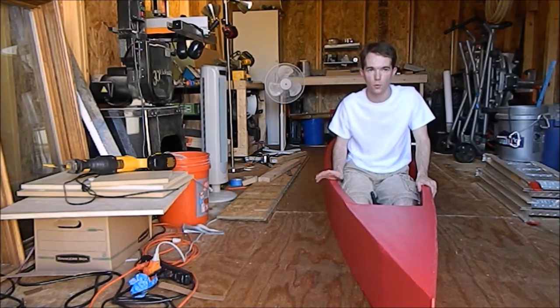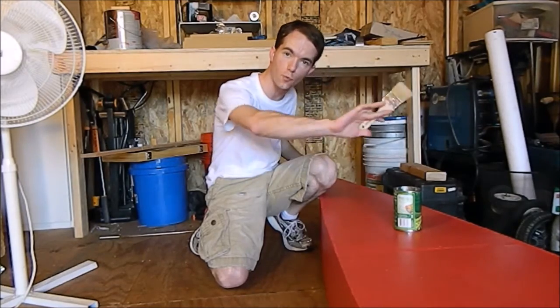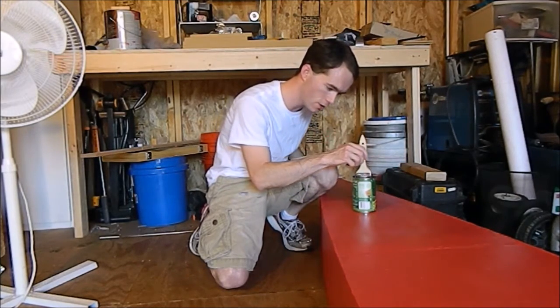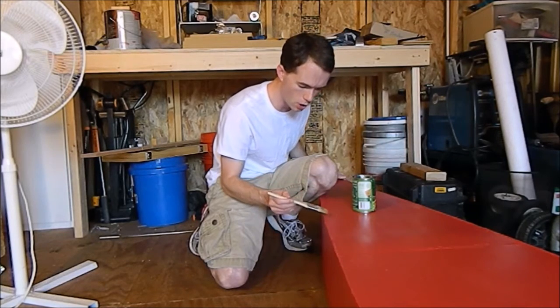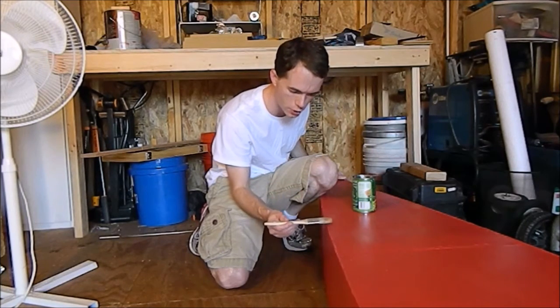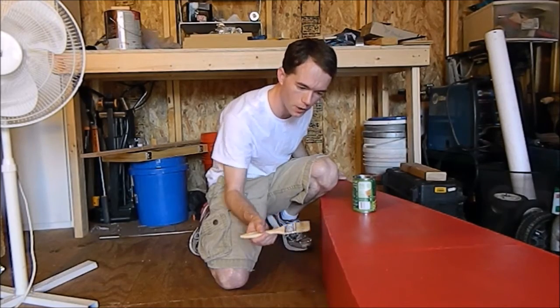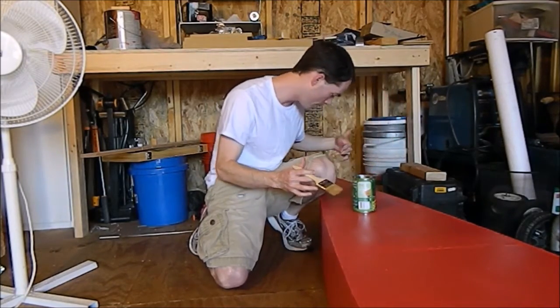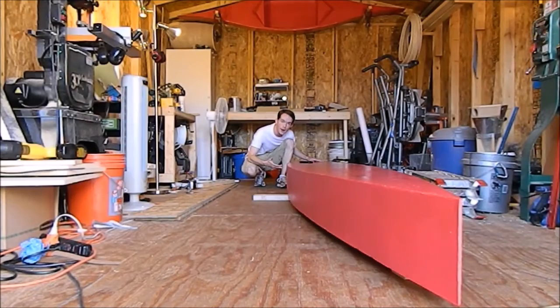Well, it's time to finish this up — we're on the home stretch. I'm going to varnish it the same way I did with the paint, starting at the back of the shed and working my way forward, doing the entire bottom and making sure all the edges are really sealed up. I've transferred some varnish into this little old bean can. I'm going to make sure all my edges are done really well first, then finish up with all brush strokes parallel to my grain, up and down like this. Then I'll flip it over and varnish the top and the inside.